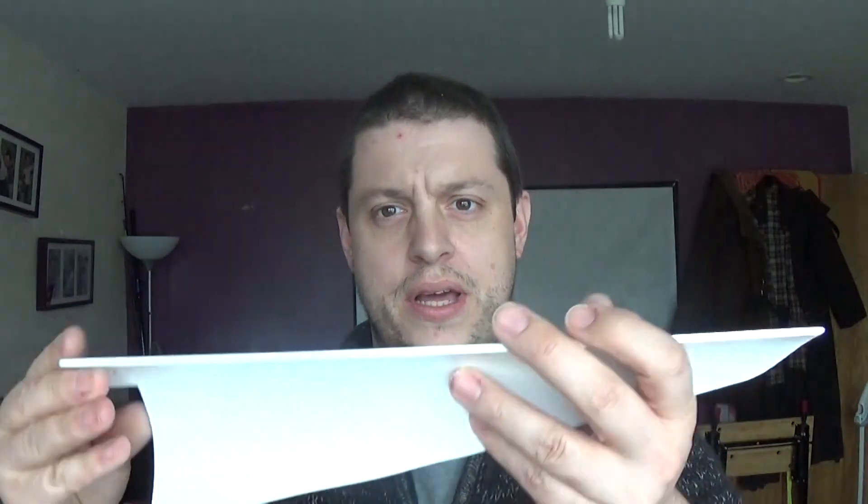So those are the motors that will generate the power. This piping will be the material I make the turbine blades out of for the vertical wind turbines. It's some waste pipe, 110mm by 3.2mm, and I have a couple of sections of it. Here's a quick sneak peek — this will be the kind of blade I'll show you how to make. It's extremely efficient and made out of that pipe, cut up into different segments.